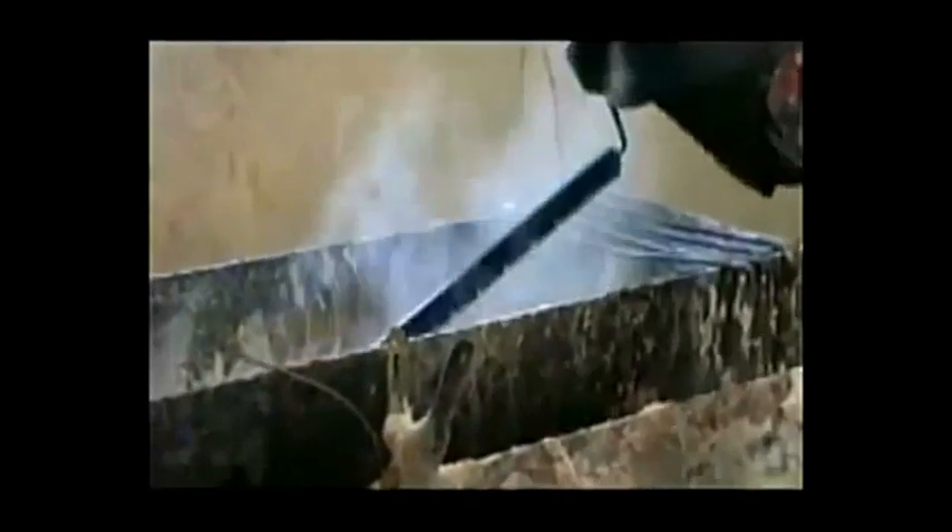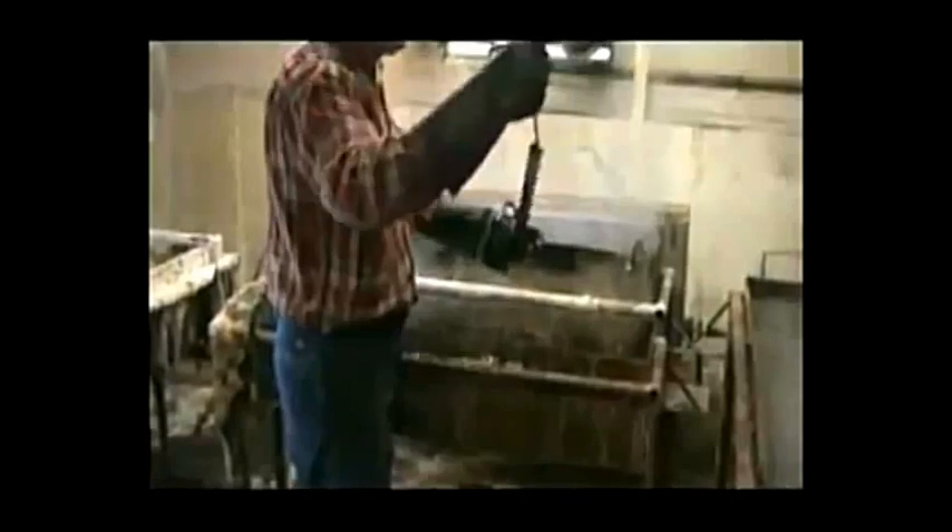The real business end is right over here — this is the salt tank. This is where we blue guns that have old receivers and silver-soldered barrels. We can't do soft-soldered barrels in that tank because the salts attack the solder and the ribs come off. So we use hot water to blue those. The tank in the far back is a silver solder blackening tank. We've been cooking an A5 barrel back there — it had a streak of silver solder along the ribs. I've now blackened that silver solder; it just makes them look more professional.